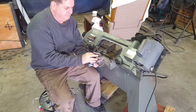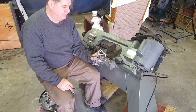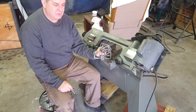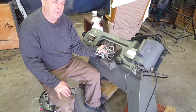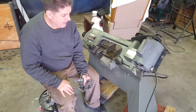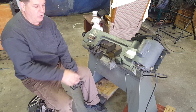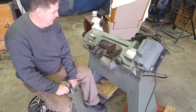All right, so guys, we got a bandsaw — at least for a while — and this is definitely better than what I had. This saw is not near as finicky as the other saw. I've done made a bunch of cuts with it and I've found that square tubing can be some of the most aggravating stuff for a bandsaw. A bandsaw loves something solid — a round piece of metal cuts good, angle iron cuts good. But square tubing like this will really test it. It starts out on the corner, then cuts through the thin parts, then hits the big wide area at the bottom. If there's anything going to cause the saw to monkey up, it'll be on square tubing. So we're going to get old Tammy's carriage modified to fit this saw and get it set in, because my saw's got to be on wheels.